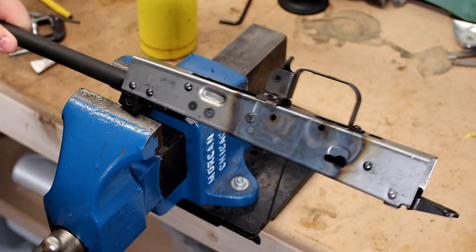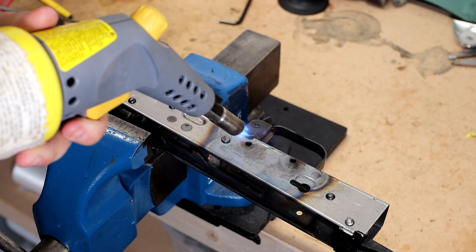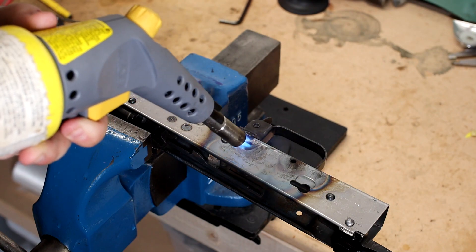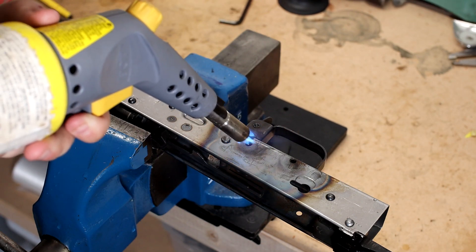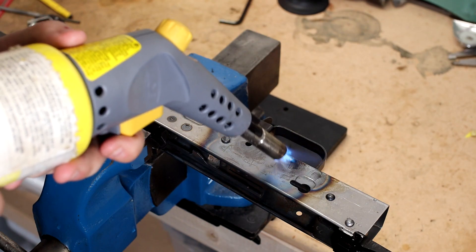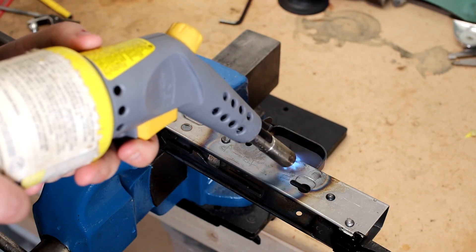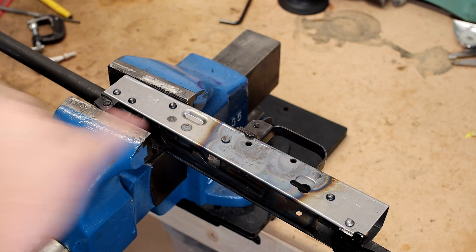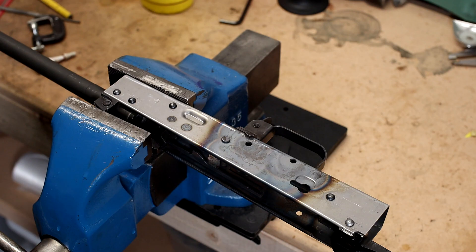This is kind of the hardest thing because it's easy when you're looking for a bright red — it's kind of hard to tell what you're looking for when you're looking for a dull gray. Right about there, you see the gray starting to spread. You can see the two spots where that gray starts to set in. We now let it cool until it's room temperature. That will temper the steel back down so it's hard but not brittle.